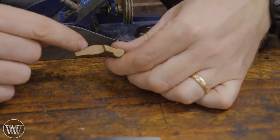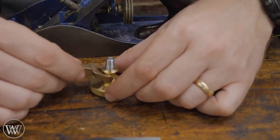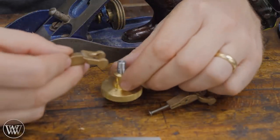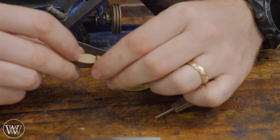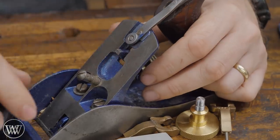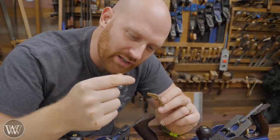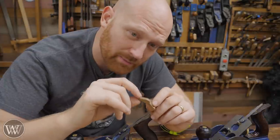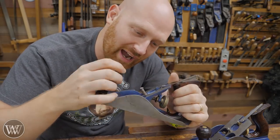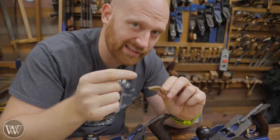This is the file-to-fit yoke. It's a bit large in all of its aspects, and it doesn't have the hole for the pin to go through it. Number one, you can file it to fit your adjuster — it's just a little bit too large and needs a little bit of work, especially if you have an old adjuster that's worn out a bit. There is some slop between the yoke and the adjuster, and you can remove that by filing this exactly to fit. Number two, there is no pinhole. You can see on the standard Stanleys there's a lot of slop on that pin — the hole is not very tight. With this one, you can actually drill the hole exactly. It is incredibly easy to do, and you can do it with a bit and brace on your bench. The frog actually provides a guide to help you drill the exact hole you need very easily.